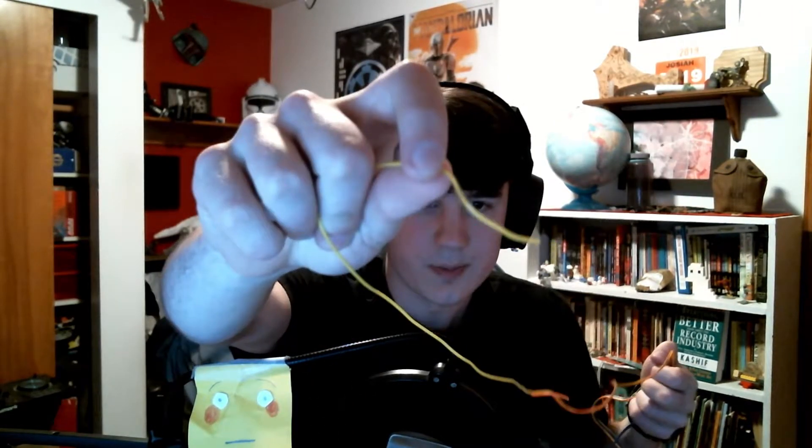My tip: don't use that thin 20 or 22-gauge wire. Get bigger 18-gauge wire instead. Buy the connectors separately for about $5 on Amazon, a ratchet crimping tool for $10–$20, and some nice thick 18-gauge wire for another $10–$20. You won't have housings, but honestly housings are for people who know what they're doing — which wasn't me.